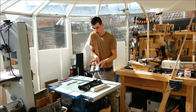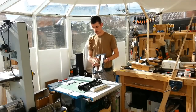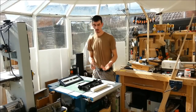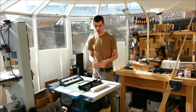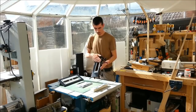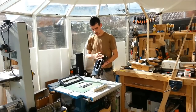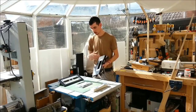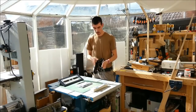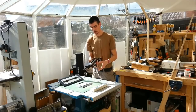Now with this one, it's all fully adjustable. So you can adjust the width of the mortise and with these stops you can adjust the length of the mortise to fit the lock you've got. This jig works in basically the same way as my little hinge jig - you get these metal insert plates which are pre-stamped and fit into the jig. With a 30mm guide and a 12mm cutter, the offset's all set and around you go. Also it clamps straight to the door, so no extra clamps needed. It just fits on the door - all you need to do is mark the centre line and across where the centre of the lock or the latch is going to be, clamp it on, and bosh.